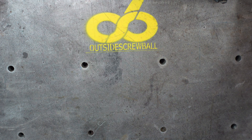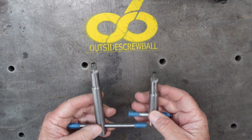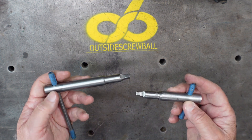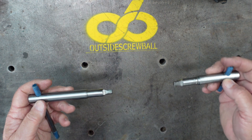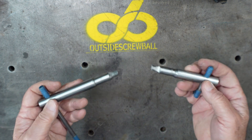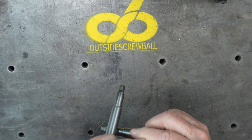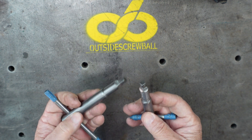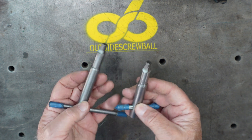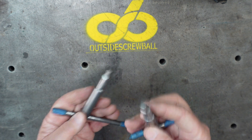Still on the lathe — four-jaw chucks. When I was starting out you'd watch guys rip around on those four-jaw chucks, and reading articles they said: make two chuck keys. Make a little one for the backside when you're reaching over the machine, and then you can tighten and loosen at the same time. Good project to make. You can see I wrapped tape on these because they were cutting into my hand. These were made a long time ago and weren't hardened or anything. A good little project — double chuck keys for guys just learning how to adjust four-jaw chucks.